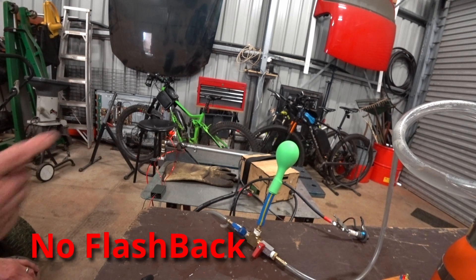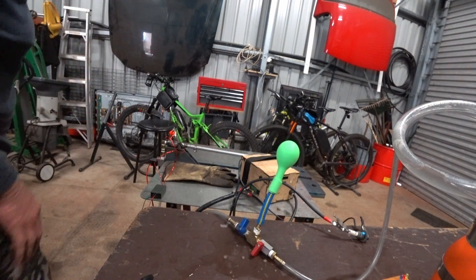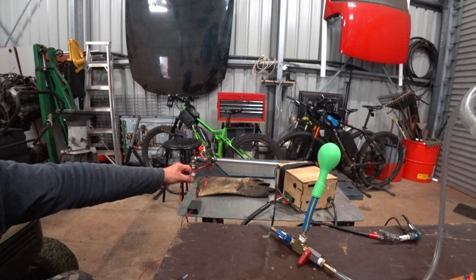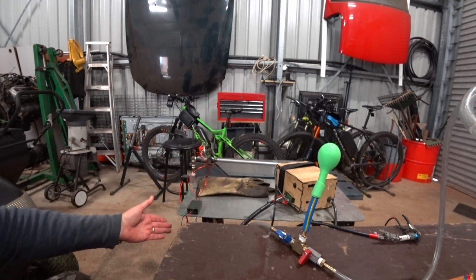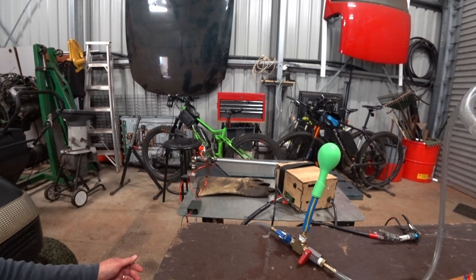It's not exploding, so I'm going to put the valve setup I've got for the bottom end in. That should retain the gas so we can make sure we're not losing it. I'll try more — three times the amount of power. We're not getting any gas. It isn't flashing back, which indicates the timing has to be wrong, because that valve is actually holding when it's got much more air in it than what I've been putting in. So it's not the solenoid valve — I believe the timing is wrong.